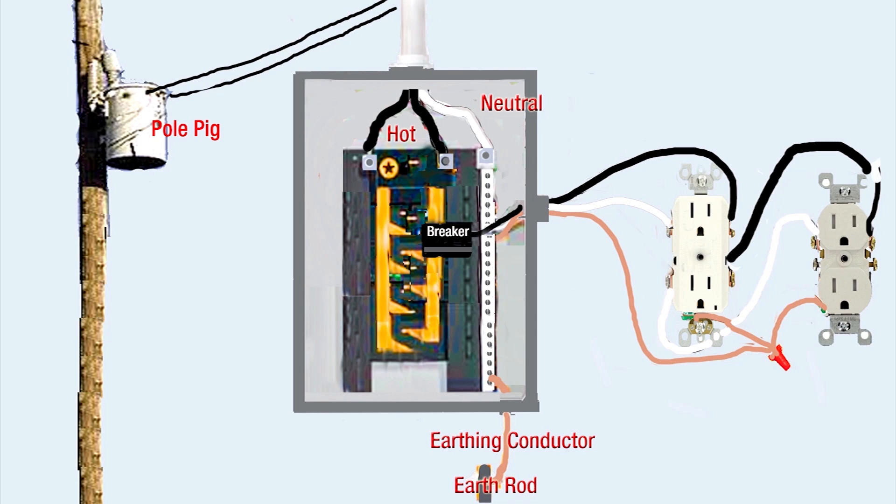So we've got a pole pig and a GFCI breaker. That breaker is the kind that will trip if a little bit of current flows through the ground conductor. So you have three wires connected to the panel: a hot, a neutral, and a ground. If some of the current flows through that ground wire, the GFCI faults. If it sees a whole bunch of current being drawn, it will also trip because it is a breaker — typically 15 amps.